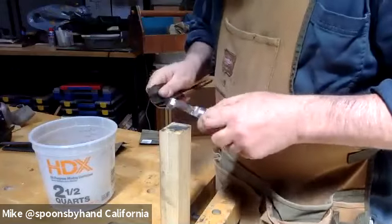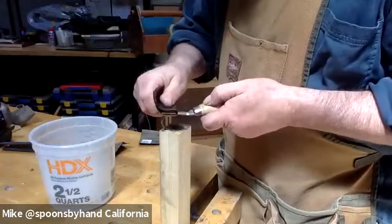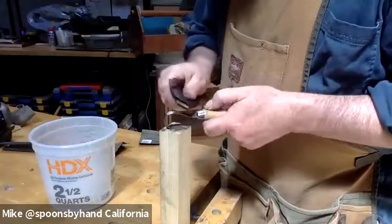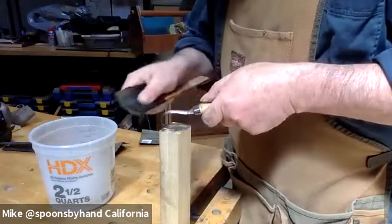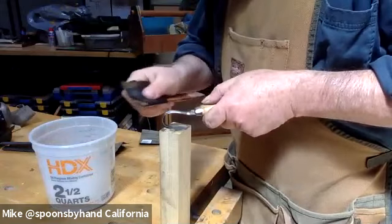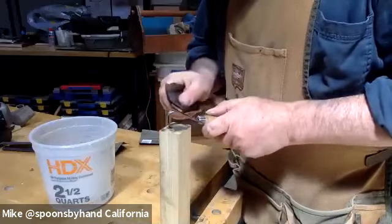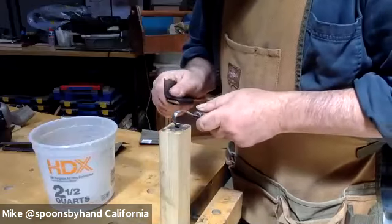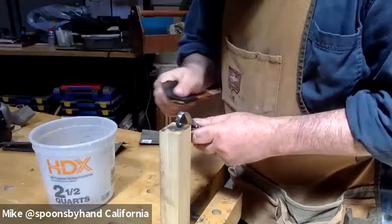I thought maybe not. So 1,000 grit means it's, for the most part, the grits are such that it takes 1,000 of them to span an inch. So that's when they talk about grits in sandpaper, that's what they mean. 80 grit means 80 granules will stretch across 1 inch. Oh, so it's like pixels. Yeah, like pixels, but with little tiny rocks.